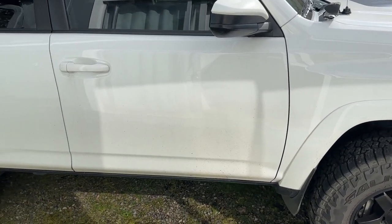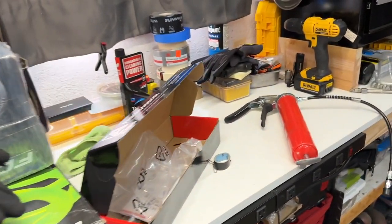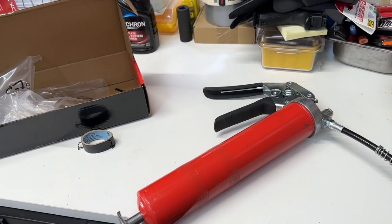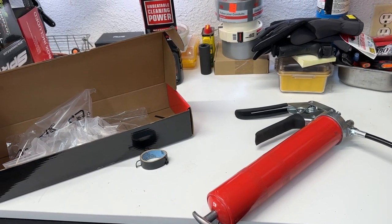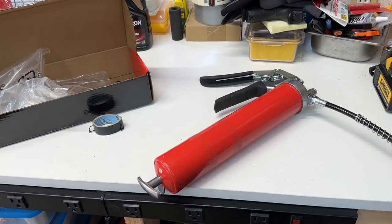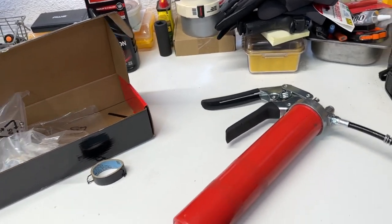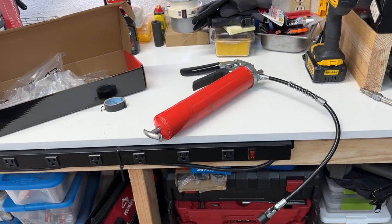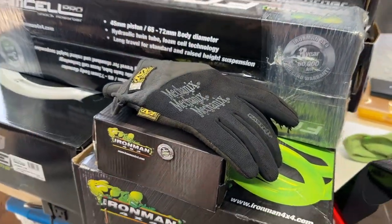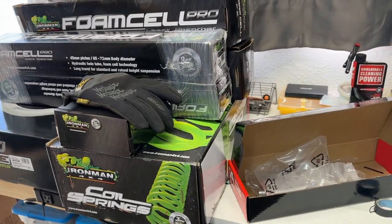That's it — all greased up. Really this is a five or ten minute job; add an hour or two because we're filming, but it's pretty simple. The only things that matter are the grease you choose — just has to be NLGI 2 and lithium-based, and you're golden. I grew up on a farm greasing machinery constantly and we never really paid attention to specs — just grabbed heavy duty grease and a cheap grease gun and went to town. I'll link everything in the description. Next up we've got some suspension changes coming.